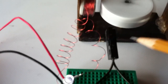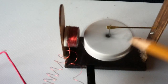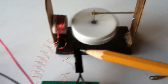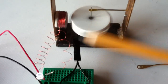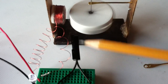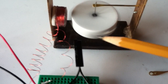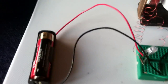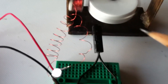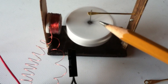I went back to just a reed switch for this just to show the operation. The wobbling needle motor was interesting but not very practical — this is. On these small motors, a regular reed switch works; that's a proximity switch for a security system, you can get them online, any kind of reed switch will work. It's running on an AA battery. What I also wanted to show was that you can take these reed switches and by adjusting the timing on it, control the RPM.